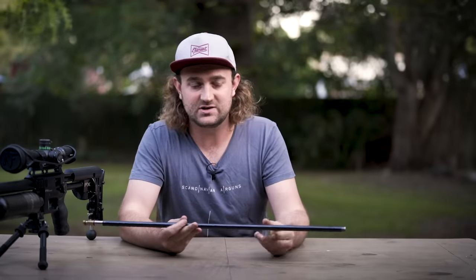I know I've said that these barrels are incredibly smooth and that no tooling ever touches the inside, and that's true, but what happens sometimes when the lands are pressed in is that you get micro fractures in the steel, and those fractures can be slightly jagged. If you look in a bore scope, you look very closely at the lands, you can see some slightly rough edges, and these basically just need to be smoothed out a little bit.